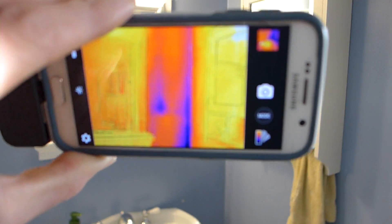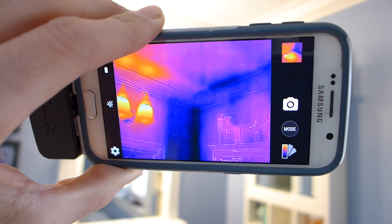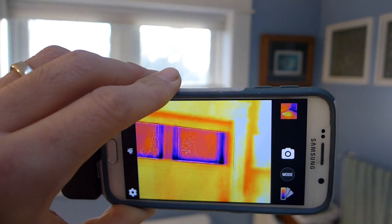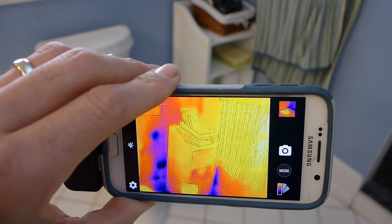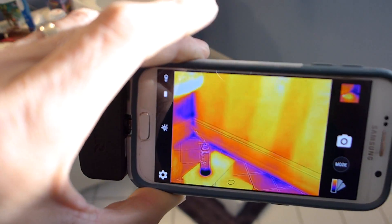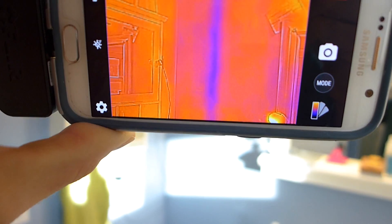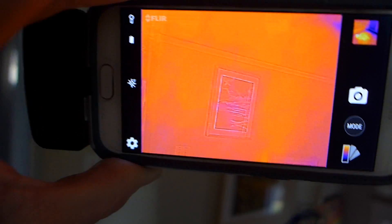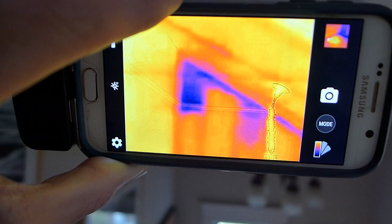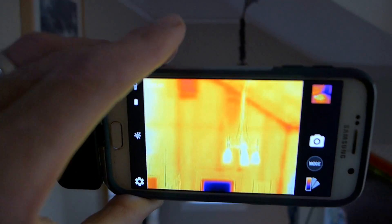You can just go around your house and tell exactly where the cold spots are — it's always a contrast. You can see the lights there are hot compared to the surrounding area which is cold. Thermal cameras do not work on glass, so if you're looking out the window just let that go. We've got a lot to do — you can see the cold area around that cabinet. It's really handy. You can use it for cars, for houses, and check out where your insulation is lacking. Here in the hallway I've got a really bad cold spot right up in that corner. The next hard part is figuring out how to deal with that — I'll leave that up to you. Thanks for watching and hopefully I helped you with sealing your house and staying warm.